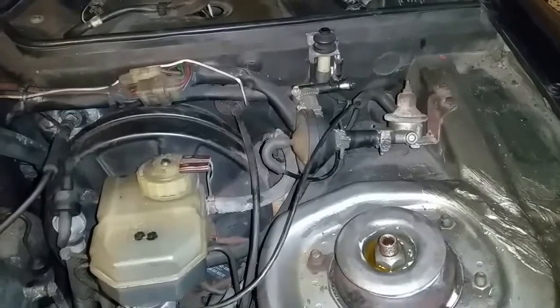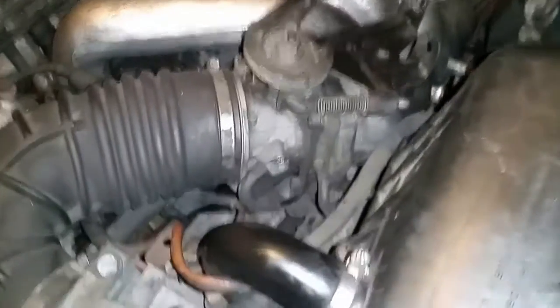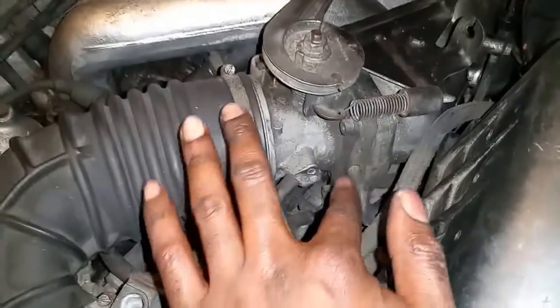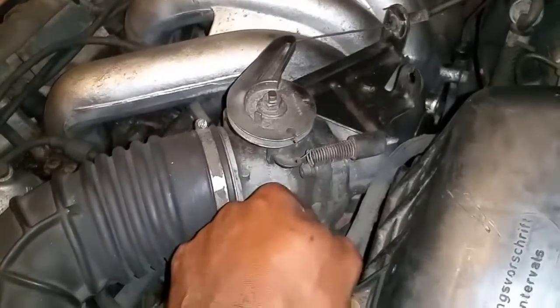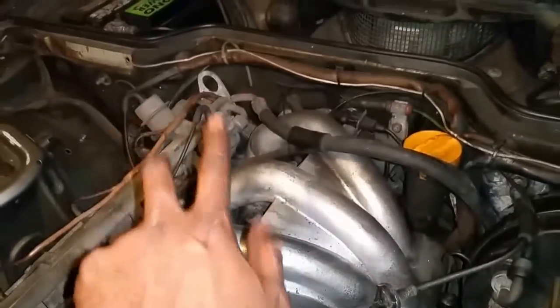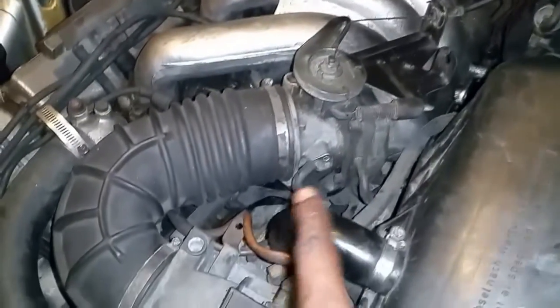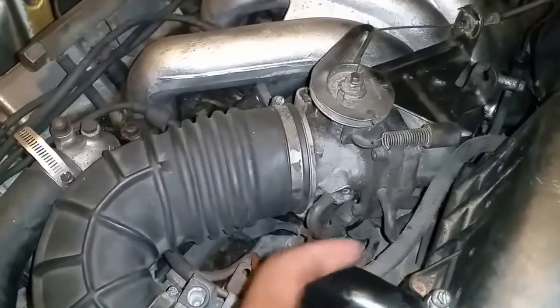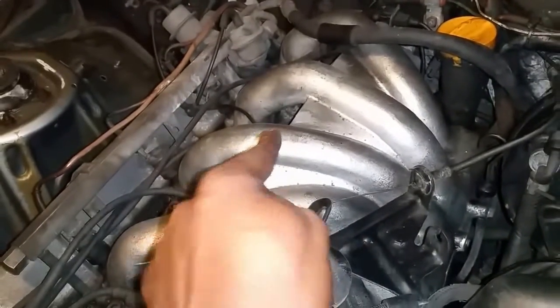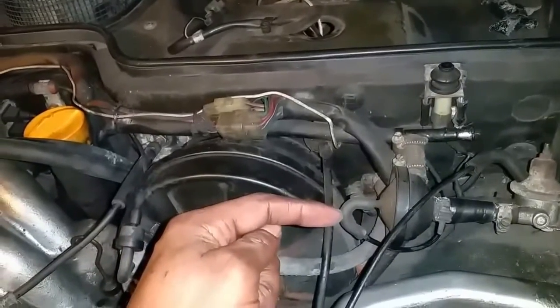That's really important — make sure you have it set correctly. For emphasis: the back piece should be going out of here, teeing off, coming over to this side where it tees off, and then the other end goes under the manifold and up to your dampener and regulator. The front one goes underneath, to your temperature sensor, and comes around to the front side of the control valve.